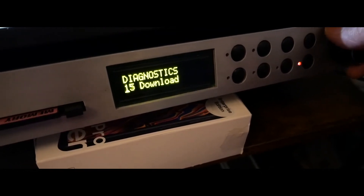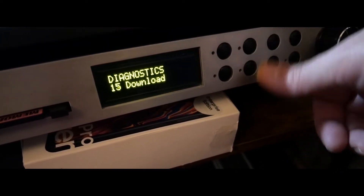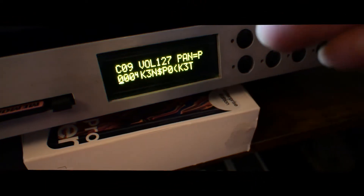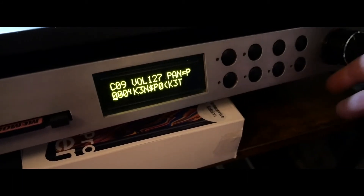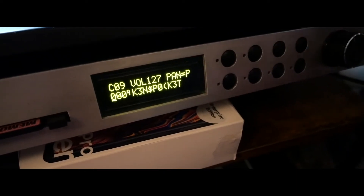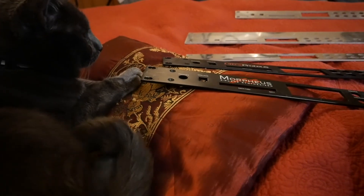We have a test for MIDI — we don't want to do this one. You'll have to plug the MIDI leads in the back to get this test to work, as it tests from out to in. The frequency response testers will play a test tone. The channel test will play various sounds and check all the channels, same for the built-in effects and the audio returns. So coming through, I don't see anything in this diagnostic menu to enable loading of the waveform SIM. Let's turn it off and back on again. Can someone write to Dave Rossum? Maybe there's a special button sequence.